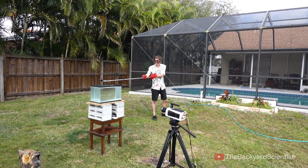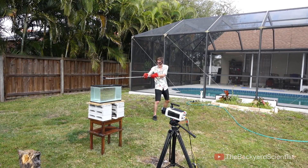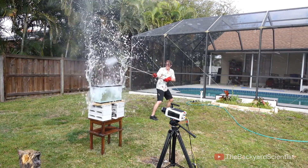To understand why moisture causes problems with our prints, it's pretty simple but you gotta go back to grade school science — what happens with water when you heat it to the point of becoming steam: it expands massively. When we have this expansion within our extruder, the steam created ends up with small voids in our print. This causes adhesion issues, aesthetic issues, and little pockmarks throughout the print.